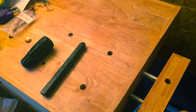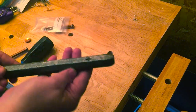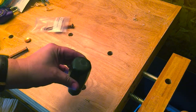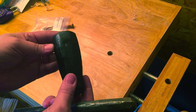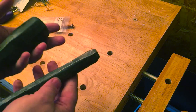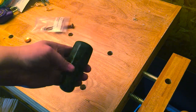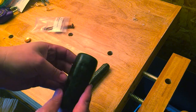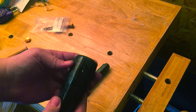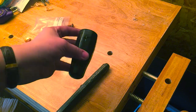Here they are in all their glory. This is the rivet setter, all done. And this is the backing. It got a little darker than I wanted — I think it was a little too hot when I put the wax on. Both are beeswaxed, so they should resist rusting for a while. This one is just pure mild steel. I didn't actually film it because my iPhone turned off — wonderful joy. I'm hoping to get a camera here soon so that doesn't happen. But pretty much all it is is a big chunk of mild steel in a rough hammer shape.